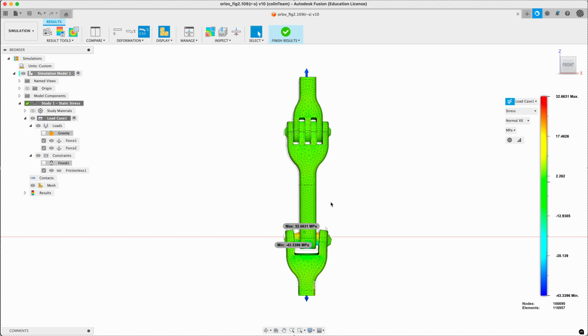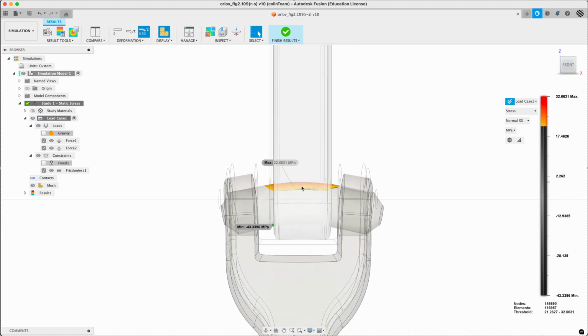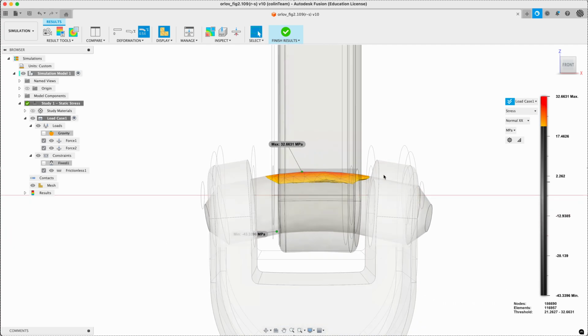See, the maximum stress, the whole thing's actually in quite a bit of stress, but you can see here what we expect to see, kind of all in tension, so about the same all the way through, with the high points where, right? So no surprise really in this shaft, which is being bent because of the gap.